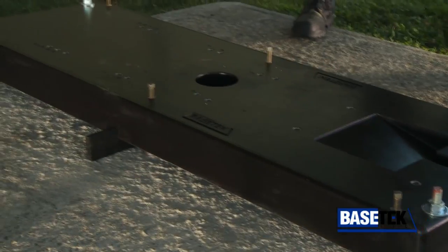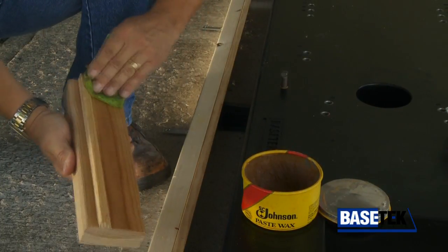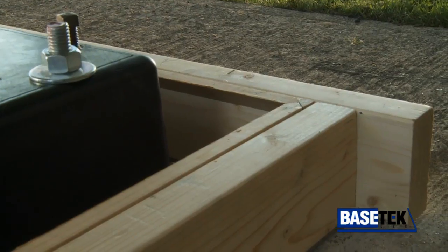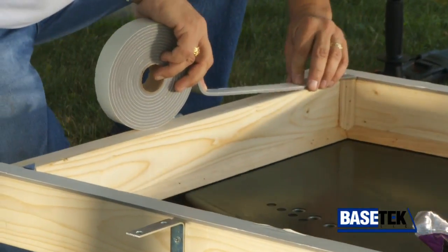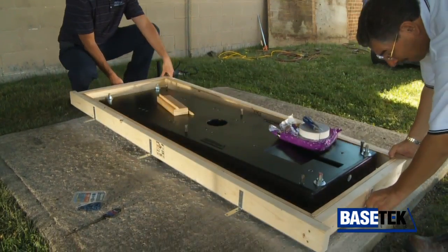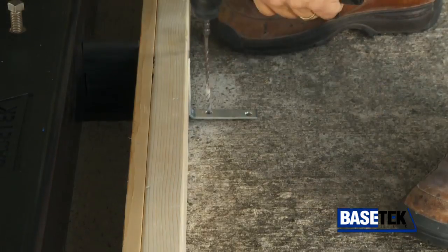Each piece is trimmed to fit between the form boards and put under the base. Step 4: Prepare and set the form, which is commonly constructed of wood. To prepare the form, wax the inside surfaces — it is important that paste wax be used. Attach a chamfer strip around the edge of the 2x4s to establish the proper grout height and break the sharp edge of the grout. Apply two-sided foam tape to the bottom of the form to seal the wood to uneven concrete so the grout doesn't leak out. Make sure the form is centered evenly around the base, then attach it to the foundation with the necessary screws.